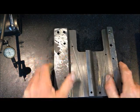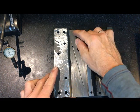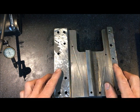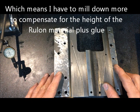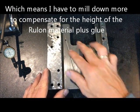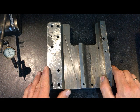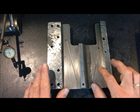I will mill down here so that these surfaces will be milled down, and I have to mill down more than fifteen hundredths — or even more than that here and here. Then I will decide whether or not I will grind it, or I think I'll put rulon on this one. And some with lesser wear I will just grind and then scrape oil pockets. Somehow I have to use my flaker sometime also, so maybe I will show that on some of these.